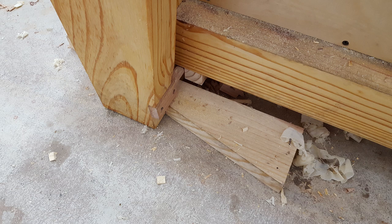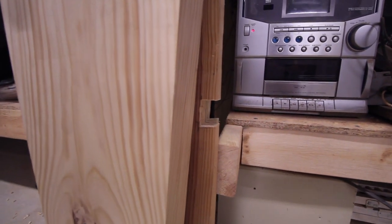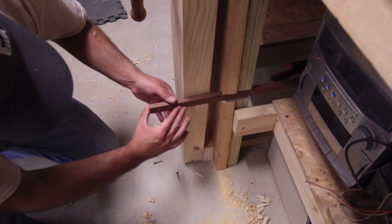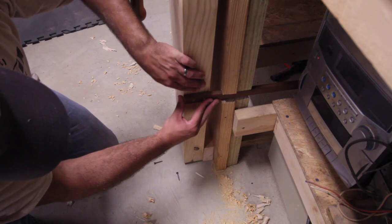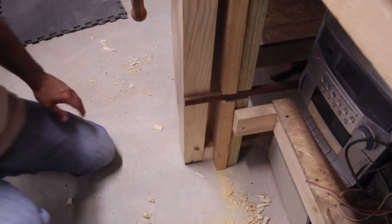The second feature my leg vise has is a block of wood — some type of pin or rod, whatever you want to use — that goes from the leg vise itself to the workbench. This prevents the front of the leg vise from rotating clockwise as you advance the screw. In Sean's case, we had to notch out a little section of the interior part of the workbench we just built up, and then secured a scrap piece of wood to fit inside this notch. Its only purpose is to prevent the vise from rotating clockwise as the screw is advanced.